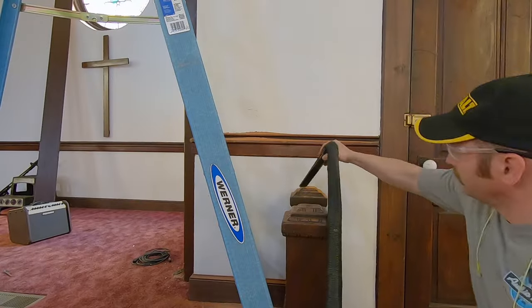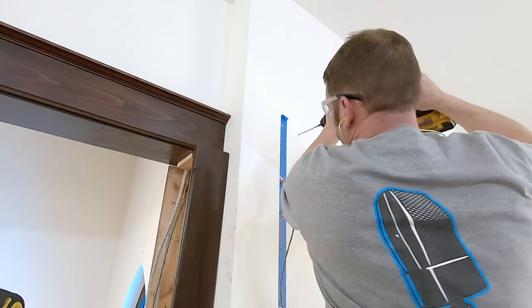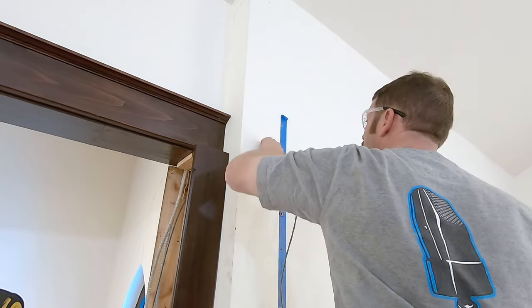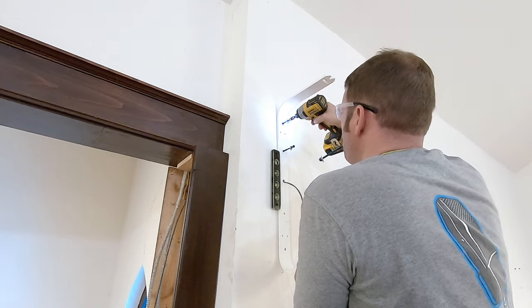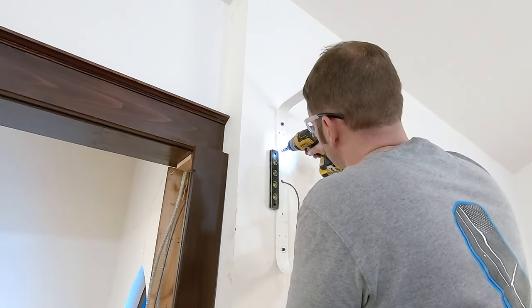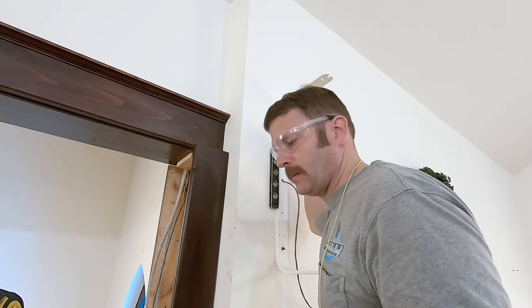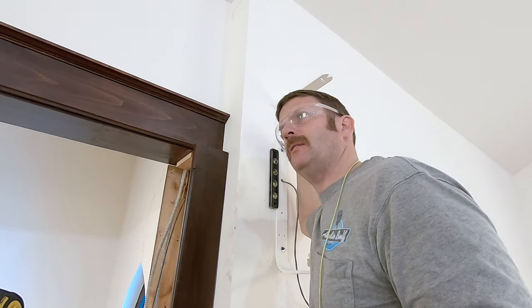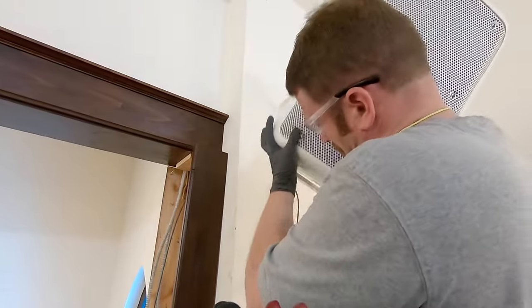Now we can hide the wire. I wanted to run the speaker wire now because once I get the bracket on, the bracket may not line up perfectly. So I want to make sure that we got the wire ran through. I like the way that one held. Because I'm uncertain on what I'm screwing into, that impact driver can strip out the concrete real quick. So I'm going to finish it off with a nut driver just to kind of feel what I'm grabbing onto. I'm listening to see if I hear stuff starting to give. I'm always so afraid I'm going to drop these speakers whenever we hang them.